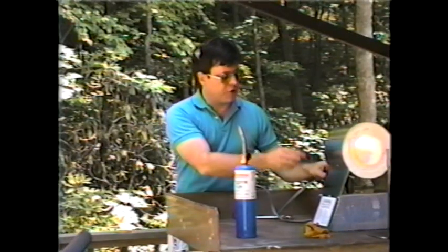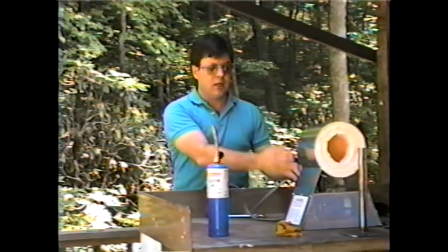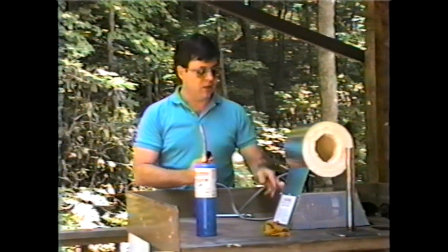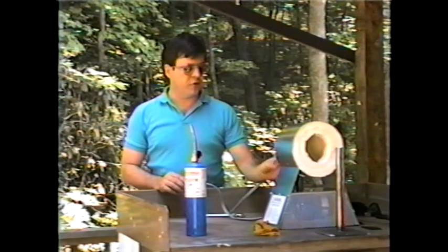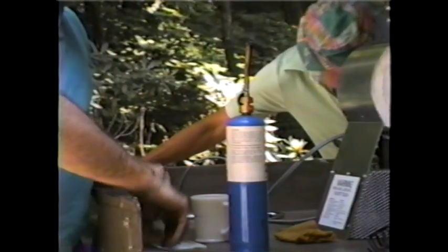When we're through with the fire bucket, we want to turn off the propane first and leave the squirrel cage going until the chamber is cool to the touch. It takes about 15 minutes to cool down. Leaving the air blowing will help speed up the cooling process. And be sure that all your valves are in the off position and turn off your propane tank.